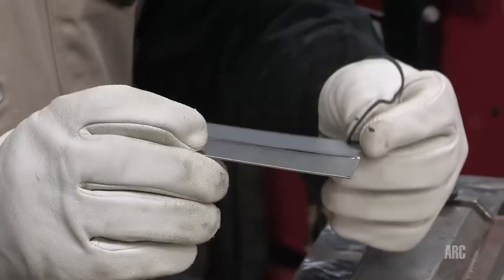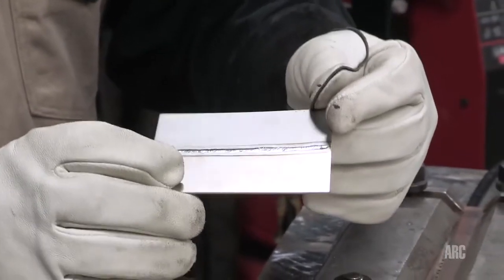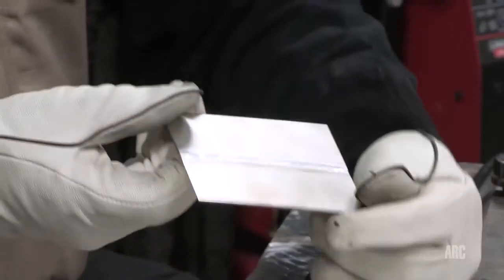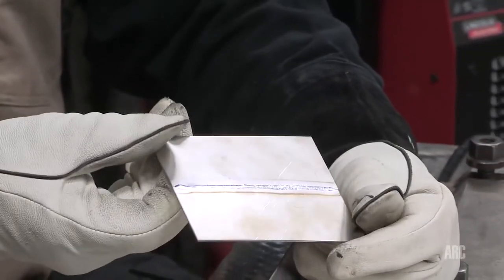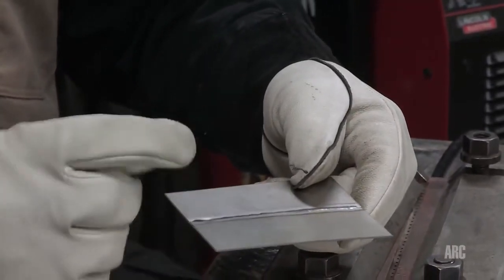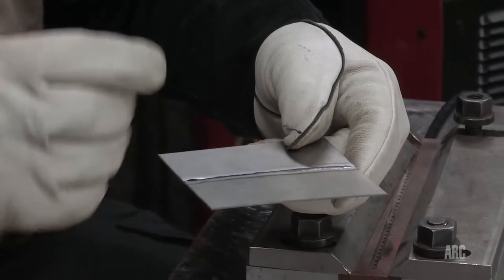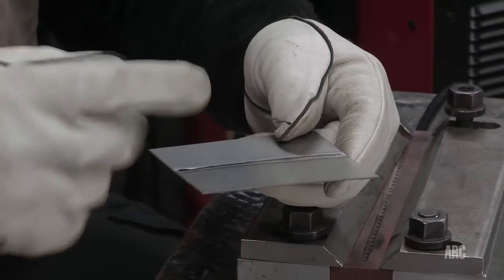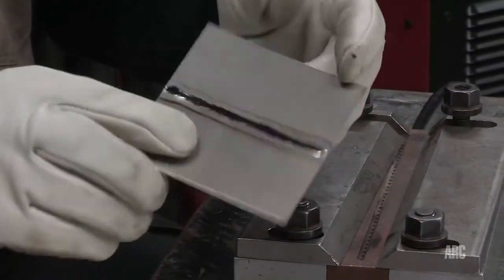Okay, this titanium looks like it did pretty good on the color inspection. The top surface where I welded is silver, and also the back side, the back purge, is silver. There's no color in there. A little bit of color further away from the weld is okay. It's acceptable to have color within a 32nd of an inch from the edge of the weld. And I'm quite a bit of ways before you see any color at all.